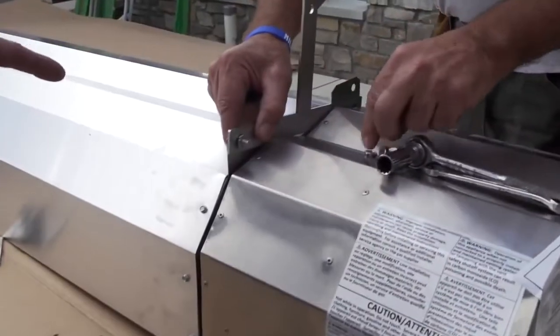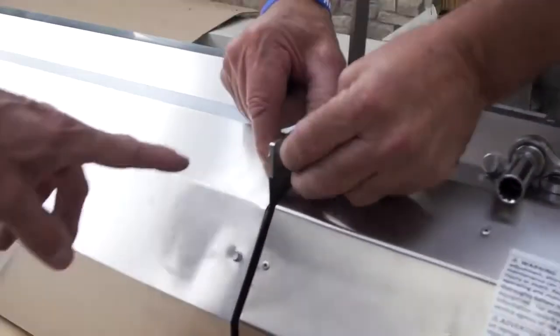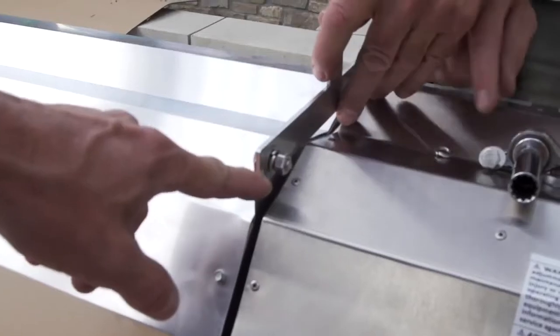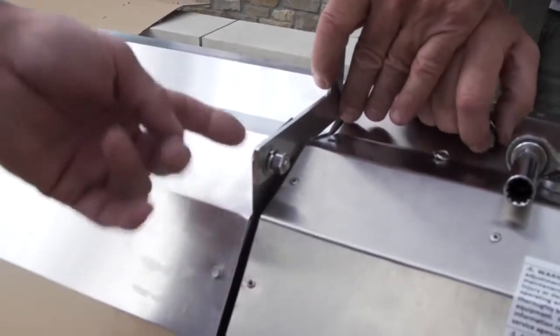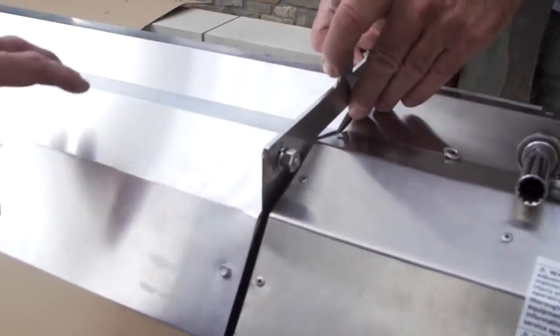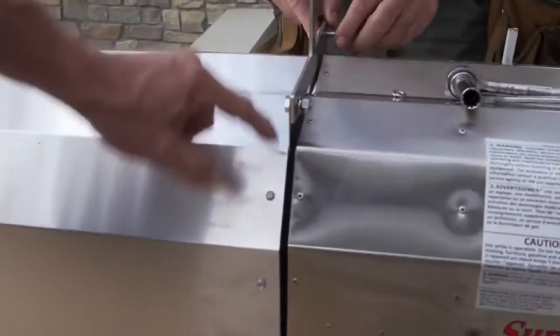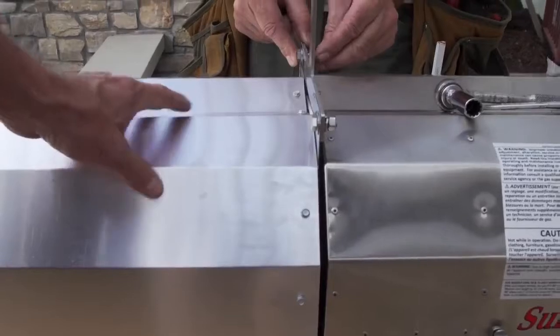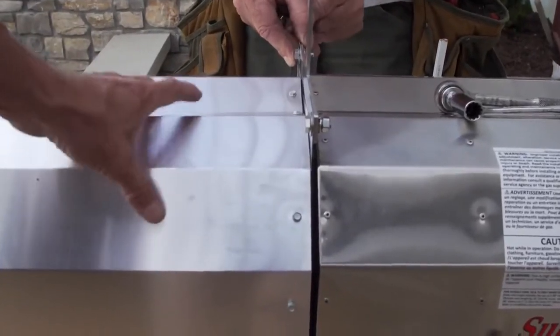Now, when we place the bracket and install the bracket, we want to pay attention to which direction the bolts go. We want to place the bracket on the outside of the rabbit ears, and we also want to drive the bolt that way, making it easier to remove these screws and remove the reflector. If it ever got damaged in the air somehow, it would make it a lot easier in the future to remove the reflector.